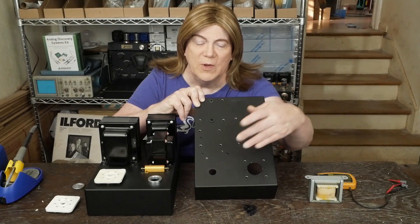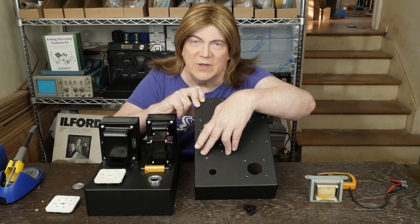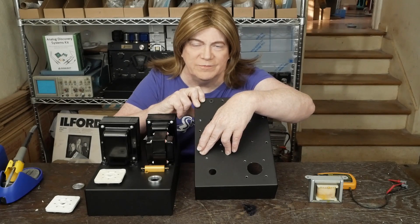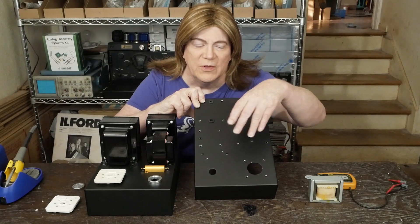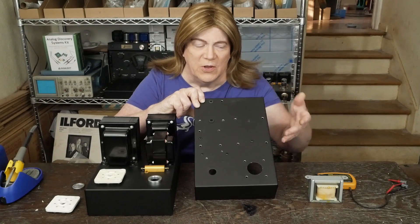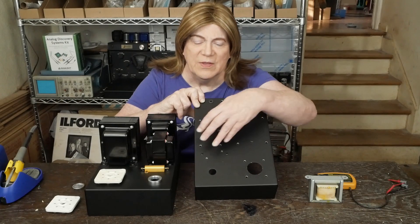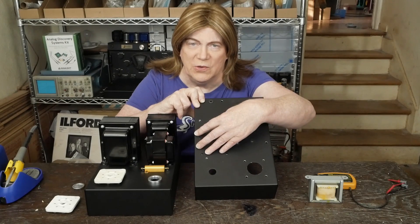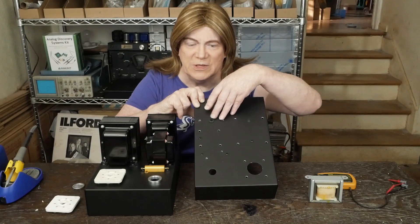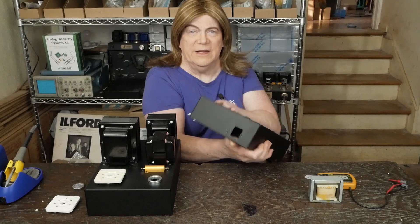This will be the driver tube. The cathode resistor is going to go across here — I know a couple of you folks said don't put it on the top, but too bad, we'll put it on the top. Then we have the output transformer sitting over here, speaker jacks coming out of the side right next to the output transformer. Then we have our plate choke, the 200 Henry guy, sitting up here. Power transformer's in the back, and we've got our IEC connector done.